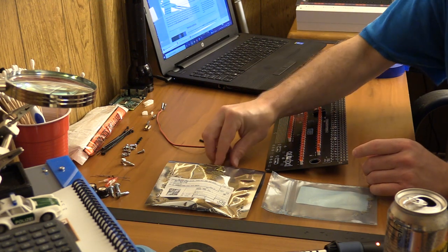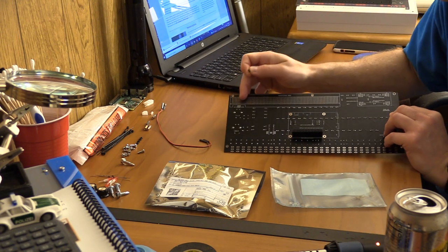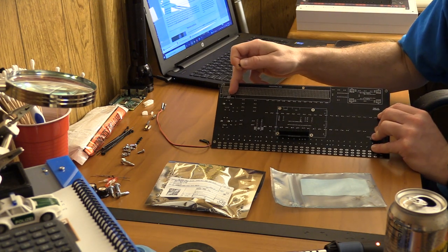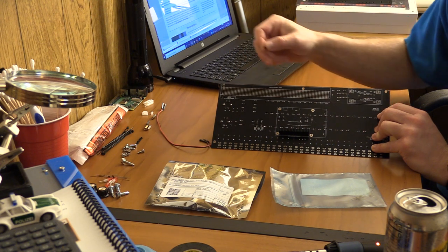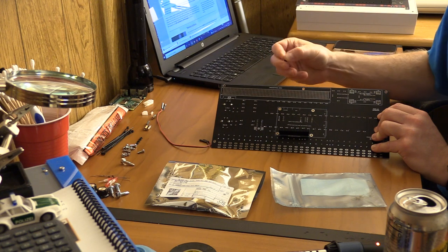So I found this in my stock of parts, and we're just going to put this on the back of the board here. I'm going to use the soft key switch power option rather than using it to just cut power to the Pi. I'm going to use it to send the sudo shutdown. So I'm going to solder this to the back of the board.